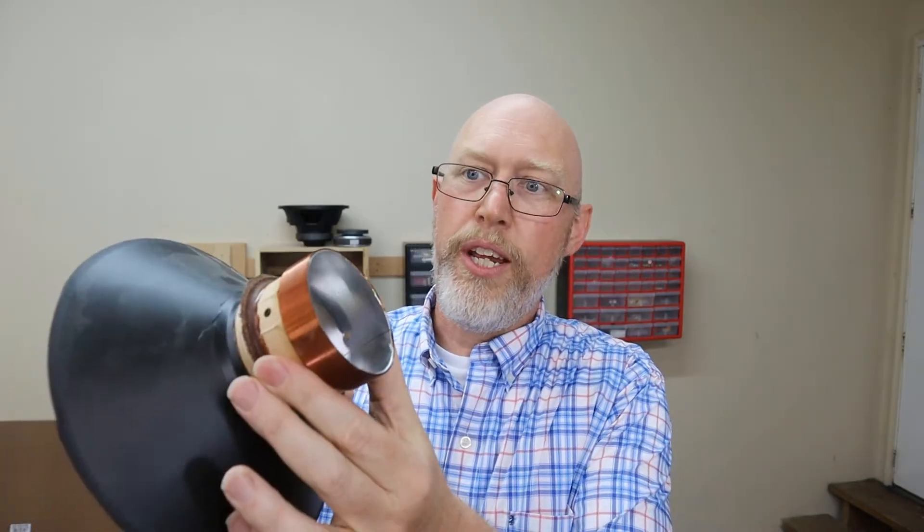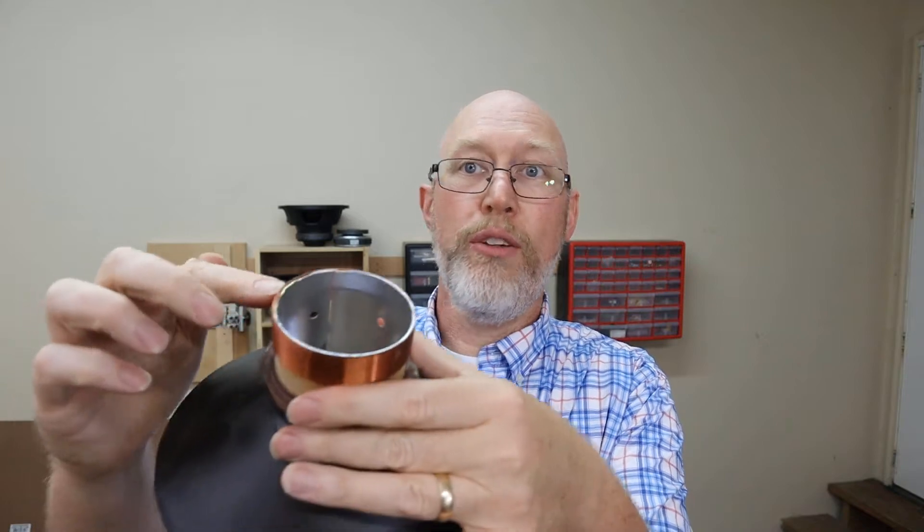This is a voice coil here, attached to a voice coil former, which is attached to a speaker cone. The voice coil is just this coil of wires right here around the voice coil former. The coil sits inside of the magnet and rests inside of this gap right here. This gap is full of metal shavings — I just keep this magnet around for demonstration purposes.